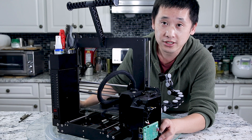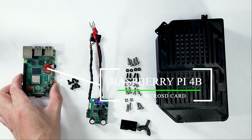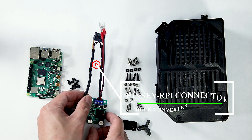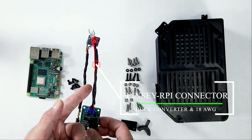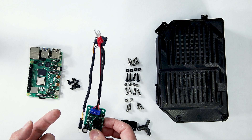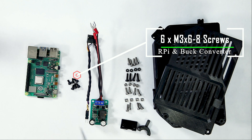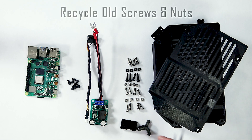Here are all the supplies you'll need. First, your Raspberry Pi with OctoPrint loaded on your micro SD card. Second, wires that connect your Raspberry Pi to your NC board, and wires for the buck converter to attach to the power supply unit. If you don't have time to assemble these, a link below will have them available for sale. You'll also need three screws for the Raspberry Pi, three screws for the buck converter, and four screws and nuts for the cover of your controller unit. Most specifications will be listed below, but in general you can get away with M3 by 10 nuts.